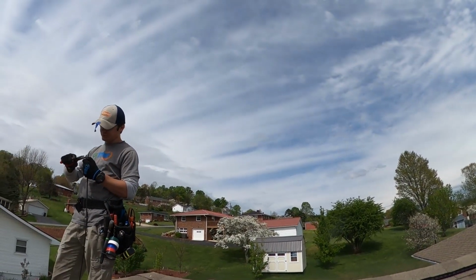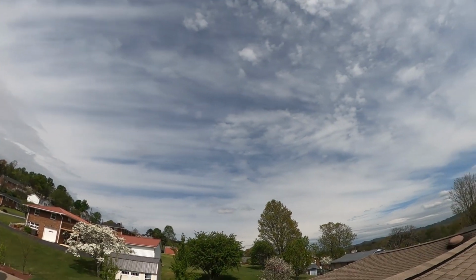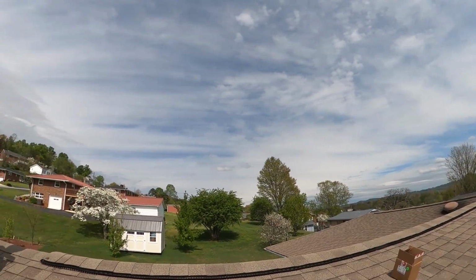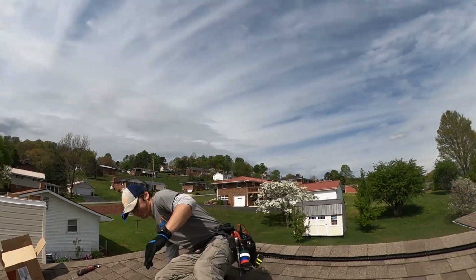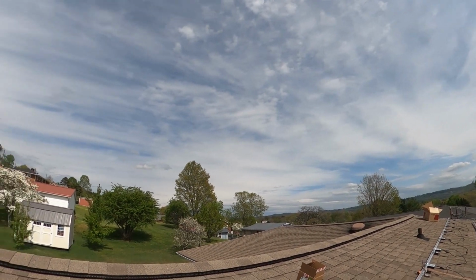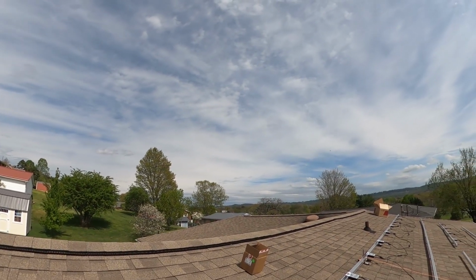arc fault, ground fault, not my fault, and it actually harvests more energy too, because it looks for the sweet spot, the maximum power point, and basically the IV curve, and it takes as much as it can, like juice, out of the panel. So an optimized system produces more, and if one panel gets dirty, the other panels aren't affected because they operate independently.